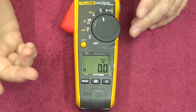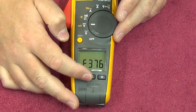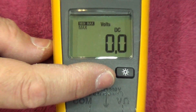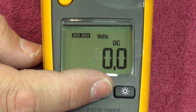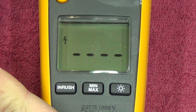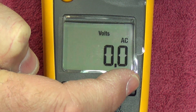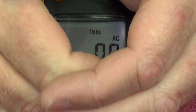The iFlex works in essentially the same way. We also have the inrush and min/max functions. The min/max gives you maximum, minimum, average, and actual readings at any time — the full Fluke min/max function, which is brilliant, and it's available in all modes. The backlight is a clean white on/off — it seems more lit on one side, but it'll definitely give you good visibility on the screen in dark environments.